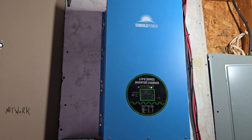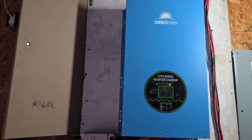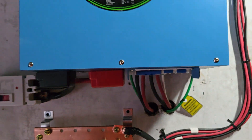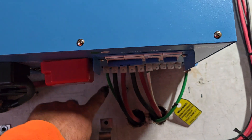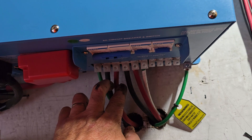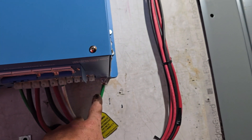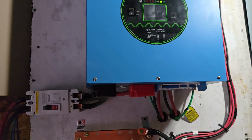This machine is just a power-producing machine. It is DC power in, AC power in, and AC power out. One thing you've got to make sure: on the input side there's no neutral — you have a ground and then your two hot legs. On the outgoing side you have two hot legs, the neutral that the machine creates, and a chassis ground. Just got to make sure that's wired right.